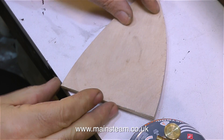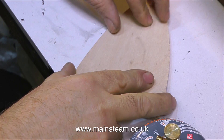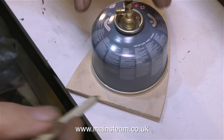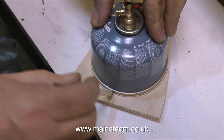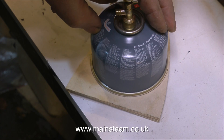You may have noticed that I'm not doing much measuring — in fact none at all. It's a bit pointless because the internal contours of the bow, with this boat being hand-carved from a piece of tree, are not exactly even at both sides. That's why I always make a card template for these sorts of jobs.